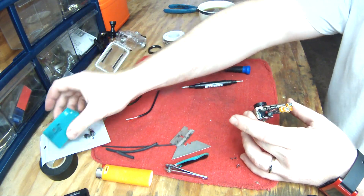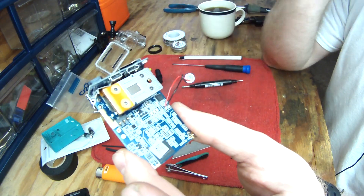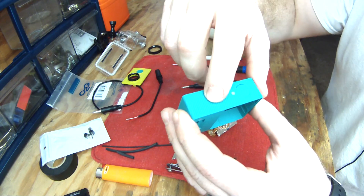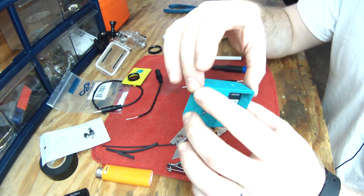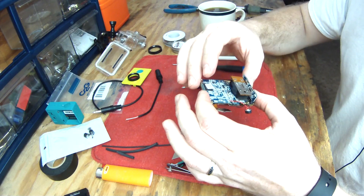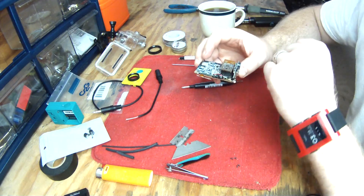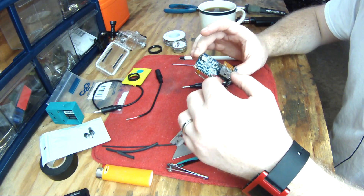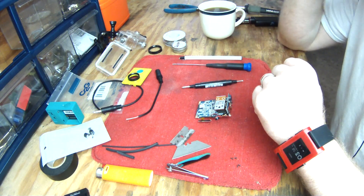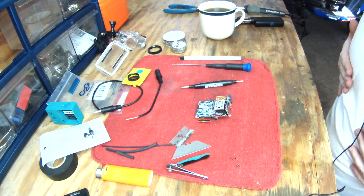Basically this is just the back of the shell — we've got the camera out. Now we can see on this side what we aim to replace today. We're going to desolder this entirely, and then hopefully thread everything through this hole, which will open up into here. I'd like to tie the wires on the inside so that if it gets yanked on, it's not going to come away from the motherboard right here. These solder pads are pretty small and appear to be surface mount only, which doesn't have the mechanical strength of something going through. But that actually makes it easier — we can just do a very light touch of the soldering iron to remove them, and then the same again to replace them with the new wires.